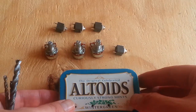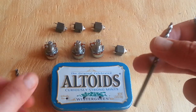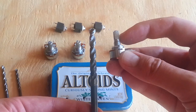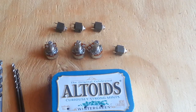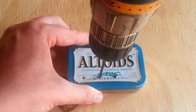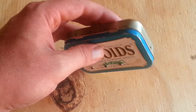I'm going to make each one of the potentiometer holes a little bit larger. I'll start out with a 1/8-inch drill, work my way up to a 5/32-inch drill bit, and then all the way up to a quarter-inch, which should be enough to thread the post of the potentiometer through the lid. With the pilot holes drilled I'm expecting this to be fairly easy — again, take it slow, as it will contort and warp the lid of the tin a bit, so keep a firm hand on it.